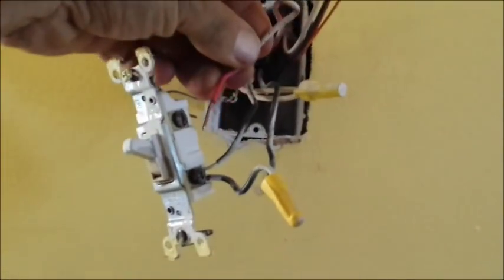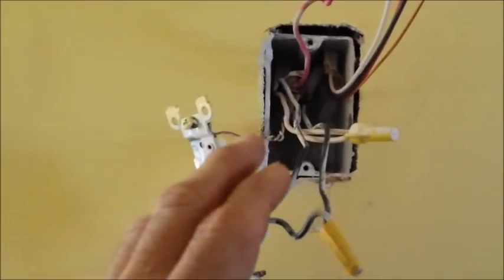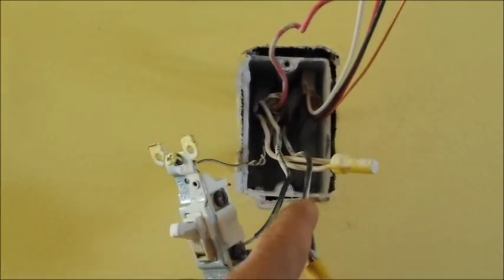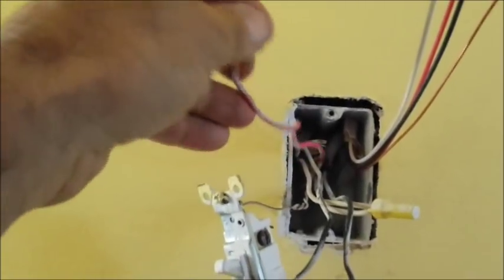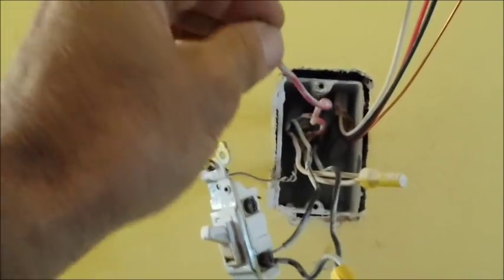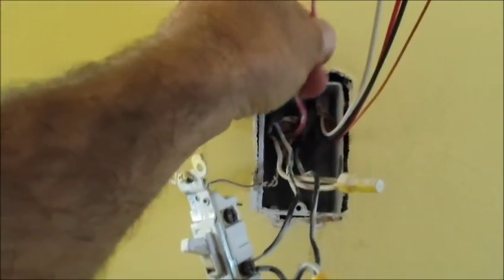We're going to remove this red wire — remember, this goes to half of our outlet on the wall, our receptacle, that is powered by this switch. So half of the receptacle is off right now. But if the breaker were on, this switch would now do nothing. Remember, that receptacle is being fed by this power wire, but half of it is split — and there's a whole other video on that. Half of that receptacle is powered by this end. So if we want to power that up when we're done, we need to make sure that this has power to it. For right now, we want to get it out of the switch.